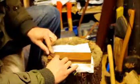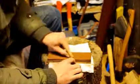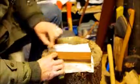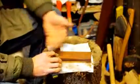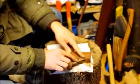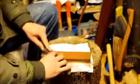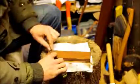So the idea here is, rather than doing it in a series of straight movements, we're going to go for one that curves up and allows the knife blade to stay on that same profile, but to come all the way down the block and off, so that it's always being ground at 90 degrees ish to the cutting edge. So here we're starting off this way, but by the time we get down to here, for that still to be the case, the knife has to have rotated not quite 180 degrees, but quite a long way through.